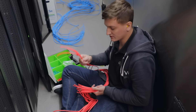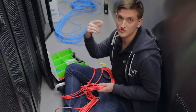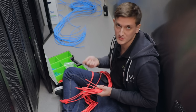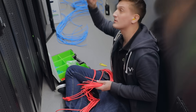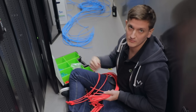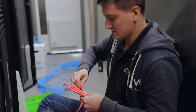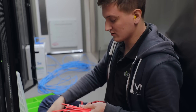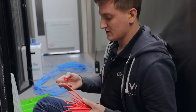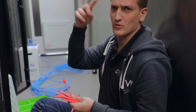At the moment I'm just putting a load of boots on the end, pulling the boots on, stripping them all back, then untwisting them, putting the plugs on, plugging them into a switch, running them down, getting measured out for length, cutting them and putting the other end on. If you guys want to learn how to do this, be it for work or for at home, we'll put a link in the description or maybe a card in one of these corners.